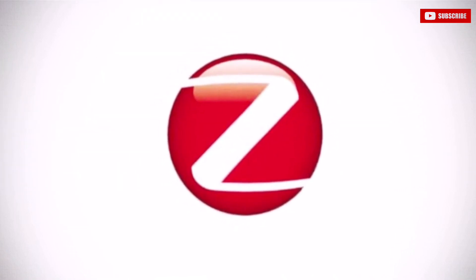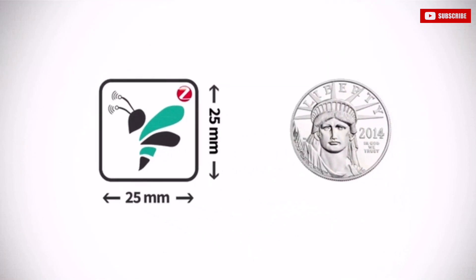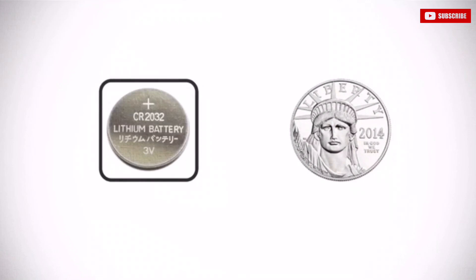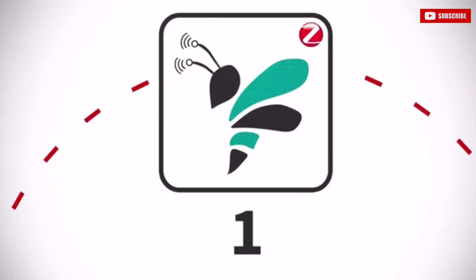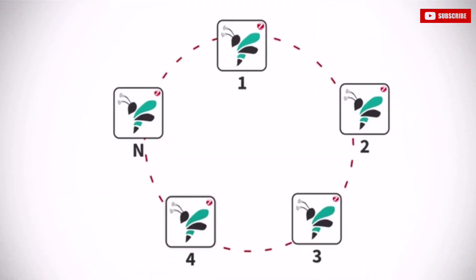We got this very new Zigbee chip. We put it in a microcontroller platform, shrunk it down to 25mm by 25mm, and lowered the power consumption so it can run on a coin cell battery for months. We wrote the Zigbee stack for you within these microcontroller platforms, so you can go ahead and just write a simple line of code within each of them.